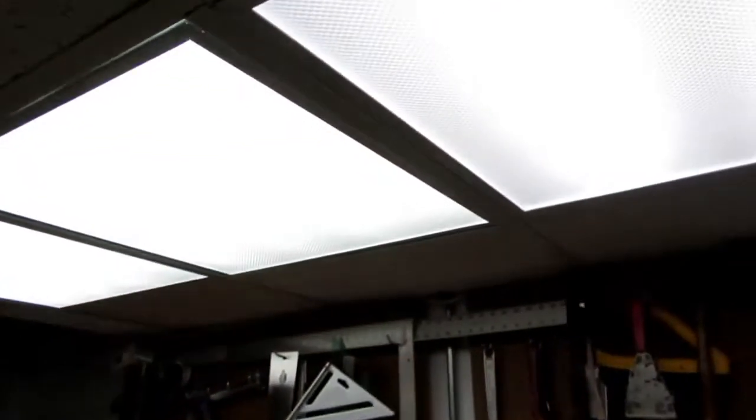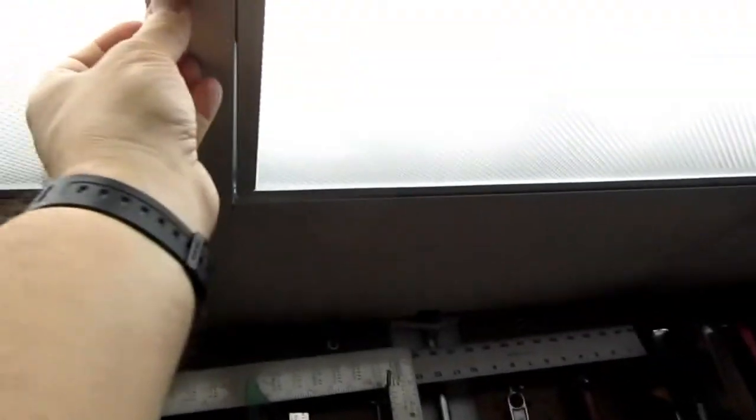Now into the suspended ceiling I've got three fixtures for much better lighting, and two of them are ones I repurposed from elsewhere. These are traditional 2x2 troffers, as they're sometimes called, which fit into the suspended ceiling frame. These particular ones use two of the U-bent T12-style fluorescent bulbs. You could also get these troffers with two or four of the two-foot-long straight fluorescent bulbs.